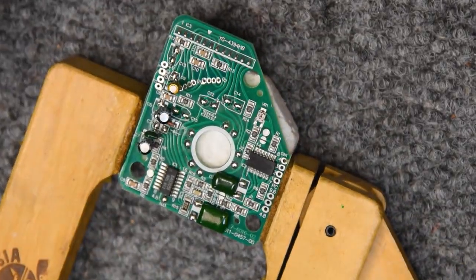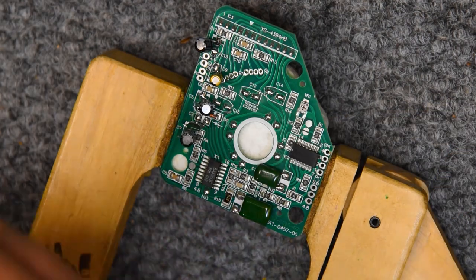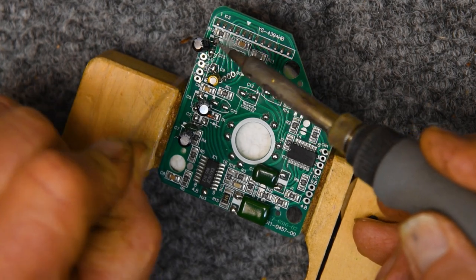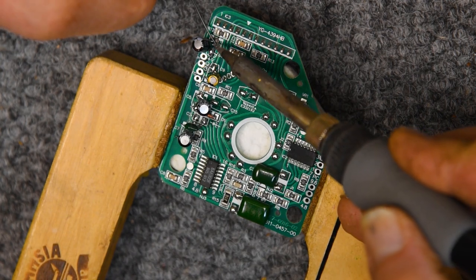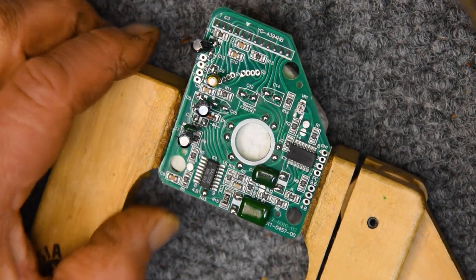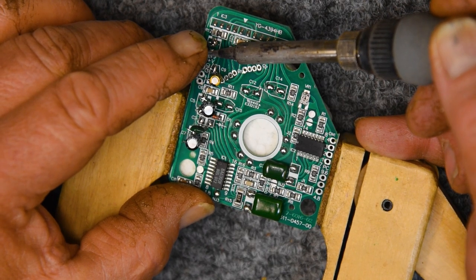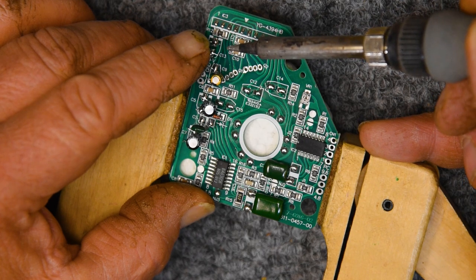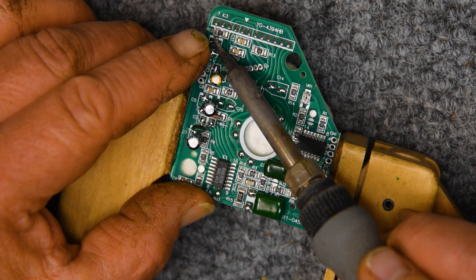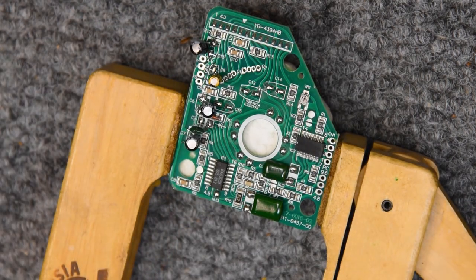That one was pretty visible. Maybe if I zoom in a little bit. Okay, there, tack it down. Push that one down. I want to completely cover those leads, and so I'm going to add a little bit more. Again, I'm not dwelling on that pad very long because everything is so clean, I don't have to. Okay, here you go. There. And you can kind of see it drop down and make contact. Okay, so that was, I think, pretty visible.